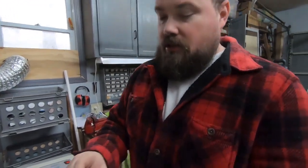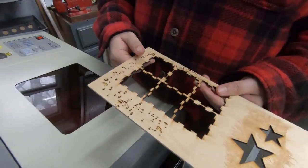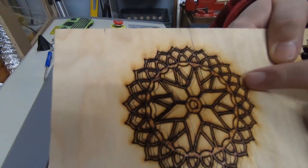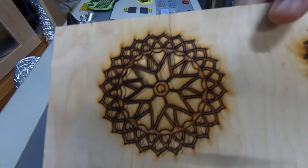It looks like the beam comes in here, it hits the sides, breaks up all over, and then we end up getting this big extra half-moon circle. We get double cuts. So the doubling we're getting out of the laser head — here's me trying to cut, and you can see that everything is doubling really bad, everything across the whole board.